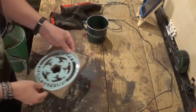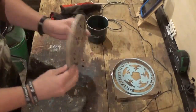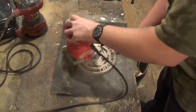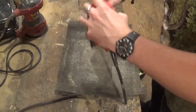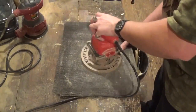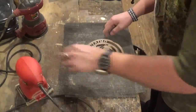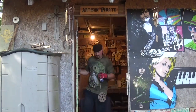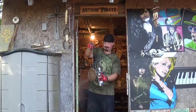Then all of the scroll work will be done and we'll take it over to the workbench, remove the pattern and the waste wood, and take it over to the palm sander with 100-grit sandpaper and sand it nice and smooth, both front and back. I'll do a little touch-up sanding off camera. Then I'm going to put the piece on a wire, take it outside, and give it a few coats of clear coat.